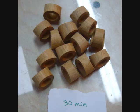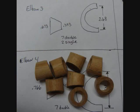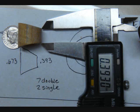At the 4-hour mark, I have started cutting up those pieces of tubing into individual angled sections to build the rounded tubing. I designed the angles using a CAD program. Each piece has an 11 1/4 degree angle on each face. As far as building the round sections, all I need to take into the shop with me is a basic drawing which shows the inside and outside lengths. Each 180 degree bend uses 9 pieces, 7 with bevels on both sides and 2 with bevels on one side.